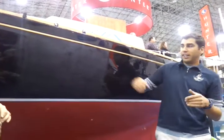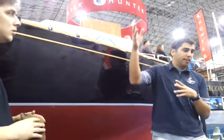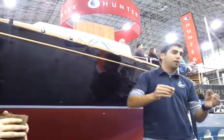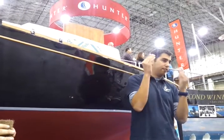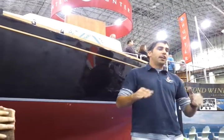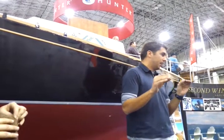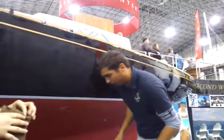And I'd like to think that hitting it with 1500 or 1000 grit sandpaper is worse than if you just left your boat out and it had a little bit of oxidation. Even with a good coat of Allcraft, if you don't take care of your boat, you don't keep it waxed, you will start to have a little bit of stuff building up there. That's fine. Your paint is still good. You can polish that and you can build a great shiny boat. So if your boat starts to fade, don't lose hope. Let me show you what we can do here.